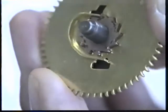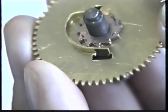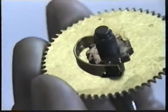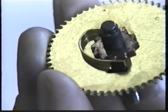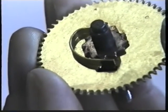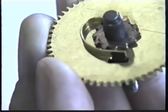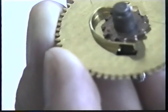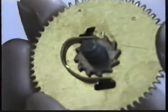The arbor is the actual shaft. In horology we don't have shafts — we have arbors and we have staffs. There are arbors called staffs and staffs called arbors, so there isn't a strict rule. Mostly balances have staffs; most other wheels have arbors. The great wheel has an arbor because something is fastened to it. Where a shaft has something fastened to it for another function — like the barrel arbor which has a mainspring hooked onto it — that becomes an arbor.